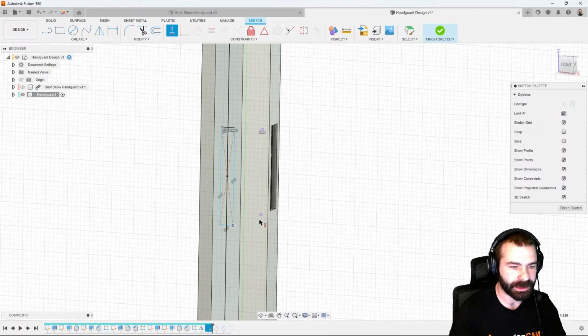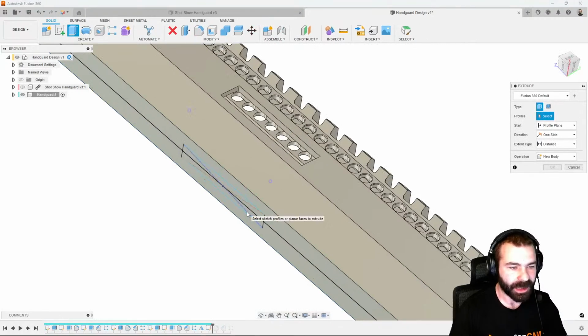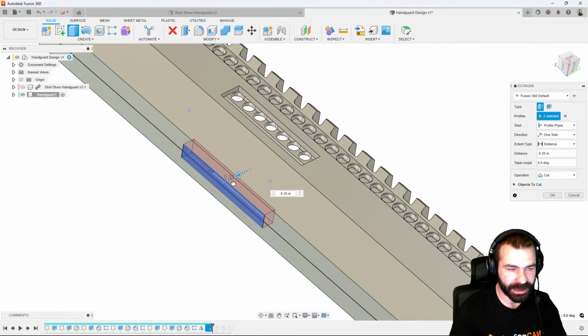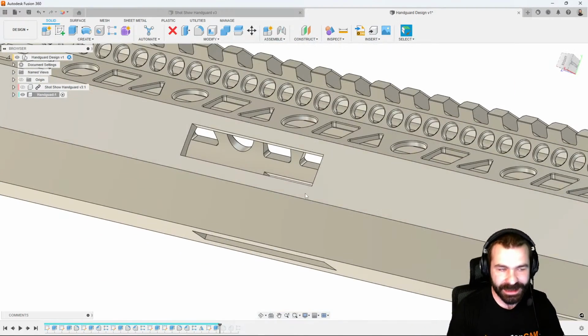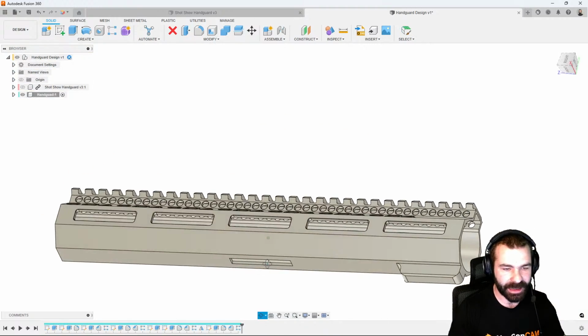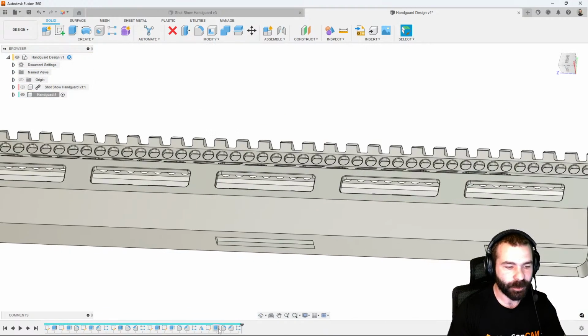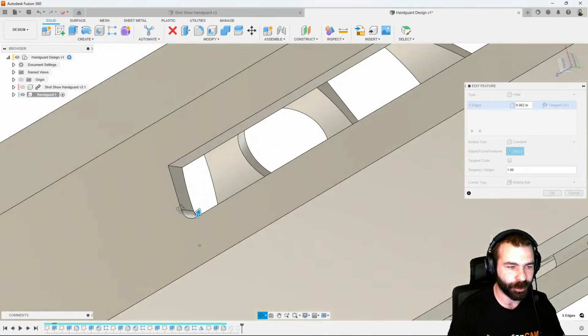So as you can see here, we've aligned everything between the two. We have everything set. Again, we're going to do that extrude. And again, the reason why we couldn't move it past that initial sketch is because it was needing those fillets to create everything, right? So again, we slide it forward as we see here. We have our extrude. And then we went in and we actually did those fillets. So let's edit that fillet and let's throw a few more in to what we have going on.